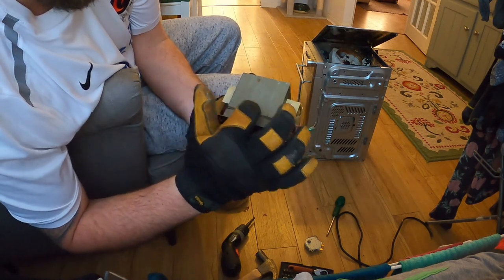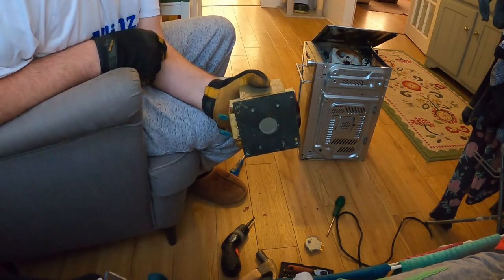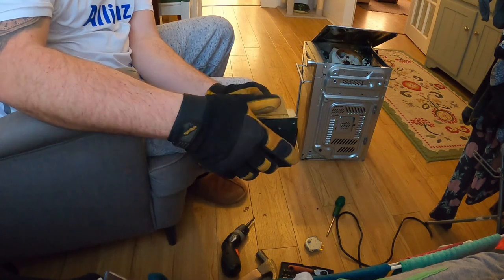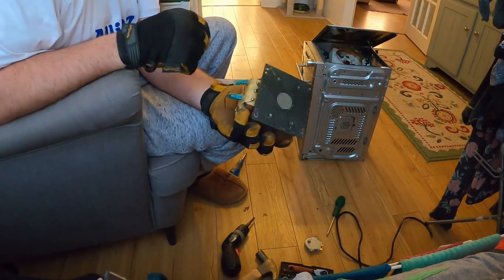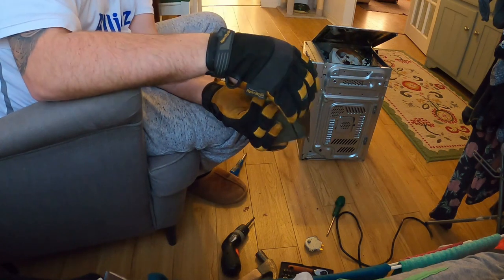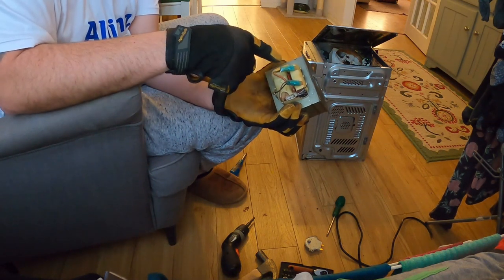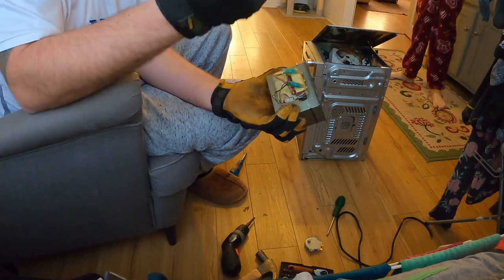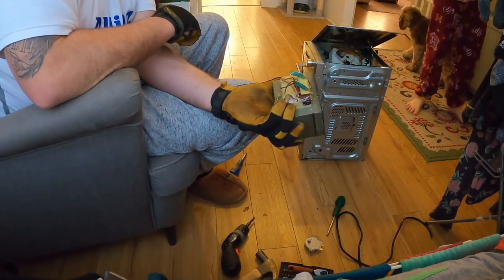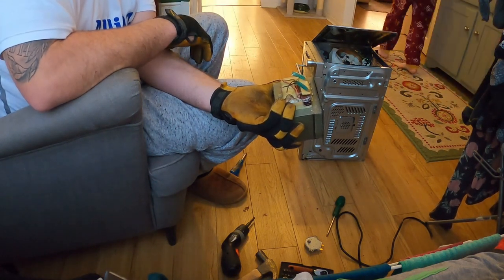Basically, see a weld line across here, a weld line across there. So you put it in a vise, or what I just do is hold it on the edge of a bench and hammer that bit. Give it a really hard hammer, the welds break, and that then just basically falls off. This one here, then, you can get a screwdriver in and wrench it out, or whack it with a hammer as hard as you can and wrench it out. And then on the inside bits here and here, there are more steel bits that go through. So again, you just get your screwdriver behind them, wrench them out, and then hammer that coil out as well. And then that is it, that's your transformer. That takes about 10-15 minutes usually, and you get two nice copper coils out of it.